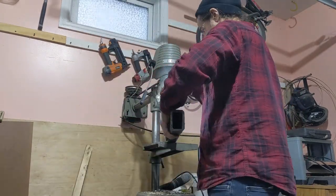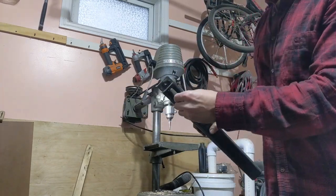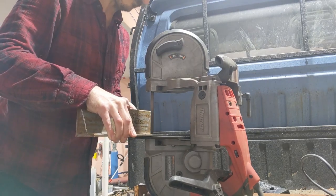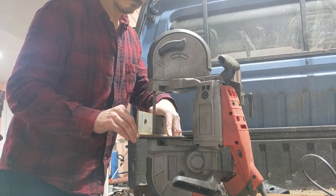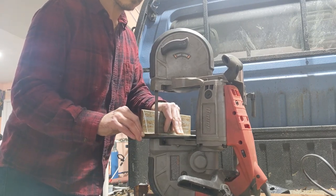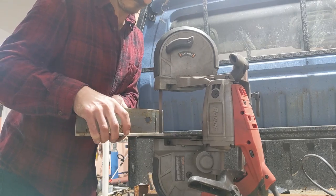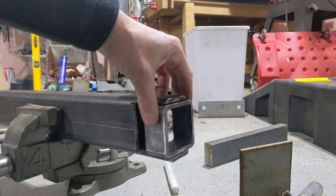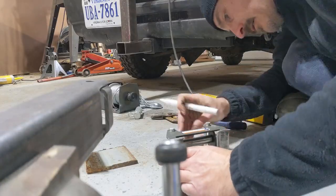Drilling out a hole here for a half-inch pin for the main arm. Let's see how that fits. I need to make these little wings for the mount plate for the winch — all of this is out of quarter-inch. Here I make an adapter out of a cutoff from a two-inch receiver hitch, and then drill out the three-eighths-inch holes for the fair lead.